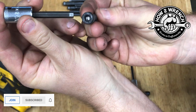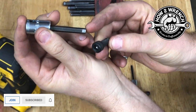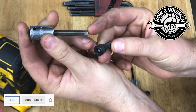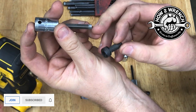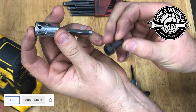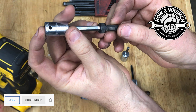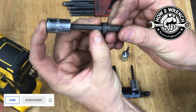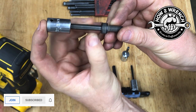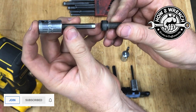Here's a standard allen that's not damaged. I've had these for probably 20 to 25 years, and you can see where the coating has worn off from new. If you look at most fasteners of a similar size, when fully inserted, that's right where that coating is — meaning I have full contact, 100%, and I'm not going to strip the fastener.